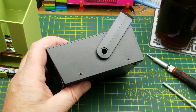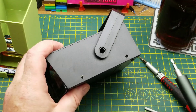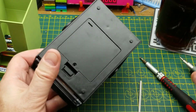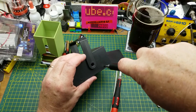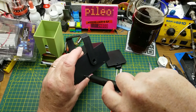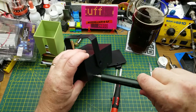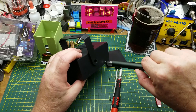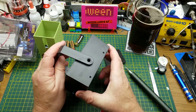This may in fact be different than the one Big Clive had, because his didn't have screws holding together on the sides. So I am interested to see what the actual circuit inside this is - and that's the real reason I bought it. Let's pull these screws out. They are, as usual, just little self-tapping screws into the plastic. What I'm expecting to find in here is obviously just a basic little flashing circuit - either a couple of transistors or a 555. I doubt it's anything more specialized or fancy than that.